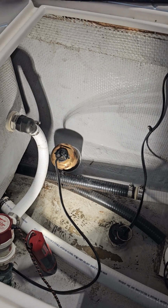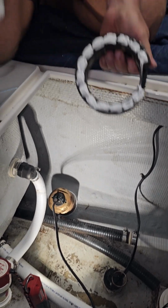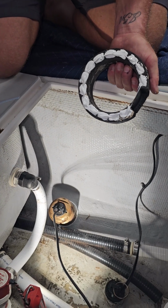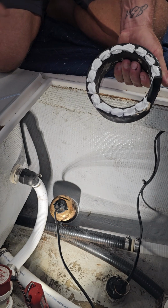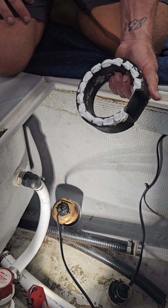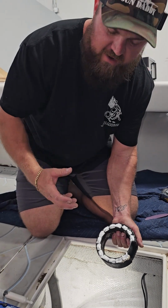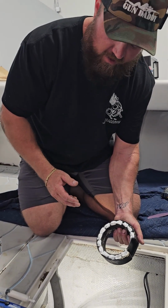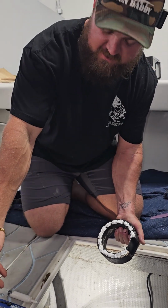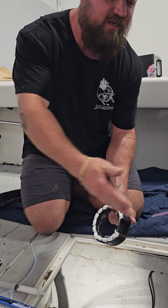One thing to keep in mind, I showed you guys filling up this backing block earlier. Do your best not to overfill it, because it's really easy, especially when you have a full length cable. I've only got like 3 feet of cable on this one, but a full cable is usually like 25 or 30 feet. It's very easy to get 5200 all over your cable and then all over you. I mean, sometimes what I honestly do is slide this down the cable, and then I'll fill this up. Do everything you can. Take some time to think about what you're doing, to prevent this wonderful sealant from getting everywhere. Even as far as, I have both of the little syringe, I have this caulking gun, they're hanging down in the bilge. It's much easier for me to clean up my bilge than it is to clean up the foam decking on this boat.